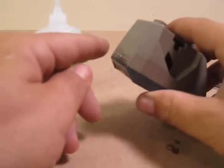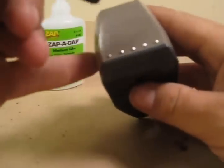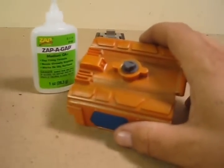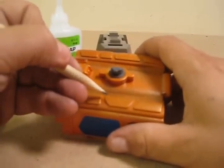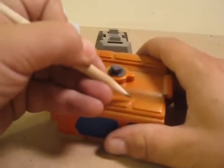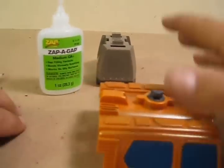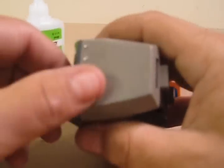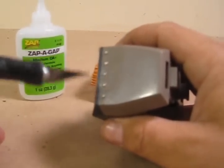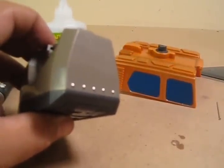And that's pretty much it. So these are actually embossed rivets now and you could go to town with these - put them all around the sides, put them wherever you want. Another cool technique would be putting them on the corners of panels, like on a military vehicle they'll typically put one here, one here, one here - and what that does it makes it look like the plate was riveted right to the actual vehicle itself. Once this is dry I would hit it with some really fine sandpaper to give a little bit of bite on those pin heads so that the paint could stick. Thanks for watching, and any questions or comments please post them below.